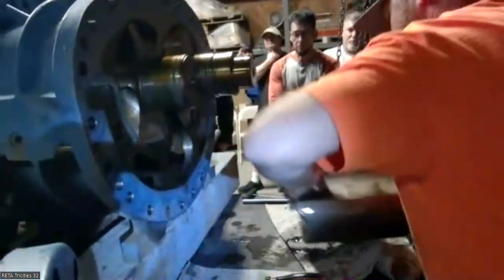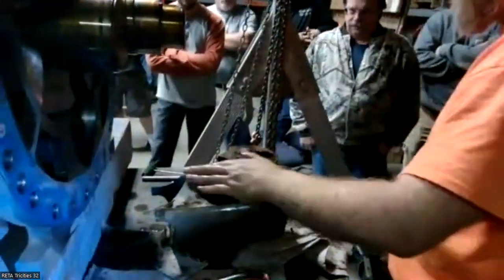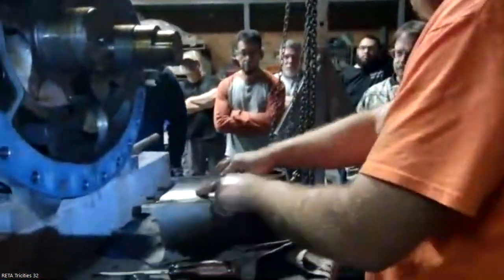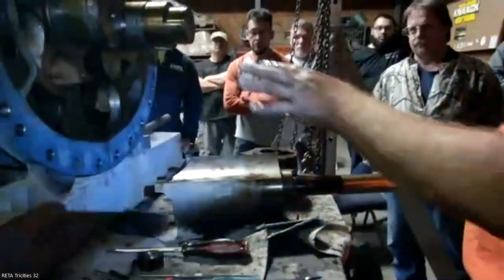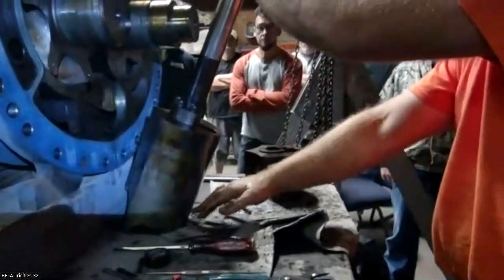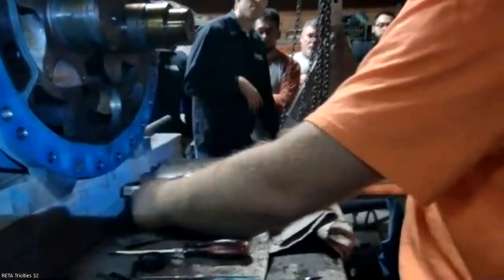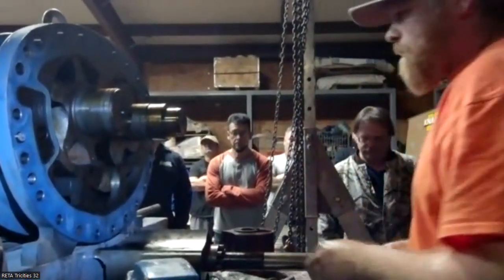That's the slide valve. So this is the valve itself. The valve itself is actually really good. Not a lot. That's where you'll see where it's fitting. Rotors are turning this way, so it always carries the material over. This was a variable, so it doesn't have a guide block. The older Mycoms actually have a slot down in here on the fixed VIs that holds that valve from rocking one way or the other. This one's going to rely more on the discharge head, where this goes through. It doesn't actually come clear out of the discharge head. You know, getting the rotors out too.